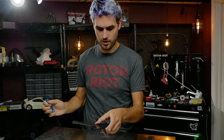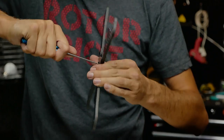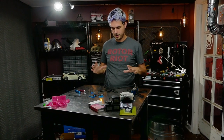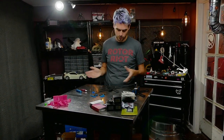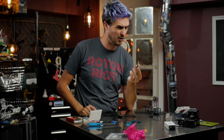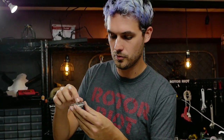With all four arms in place and screws loosely in, work your way around and tighten them all up. Now let's put the flight controller on the frame and then work from the motors back toward the flight controller. We've got our Riot Control board. Something people have been asking is how hard it is to replace the gyro, because we designed this board around a removable soft-mounted gyro case.